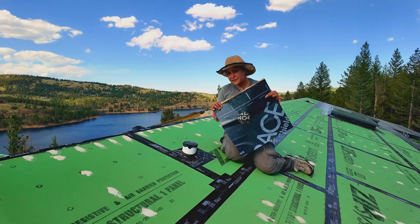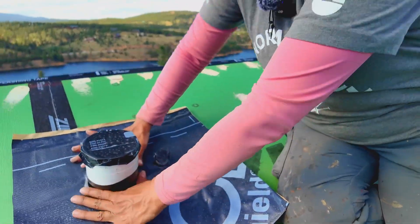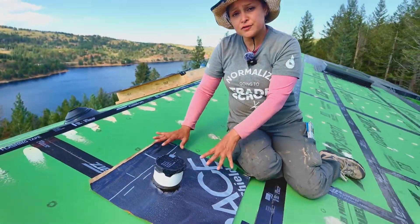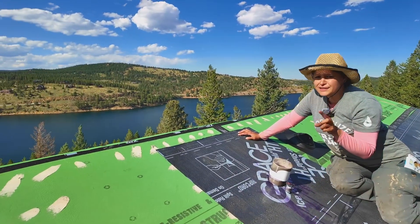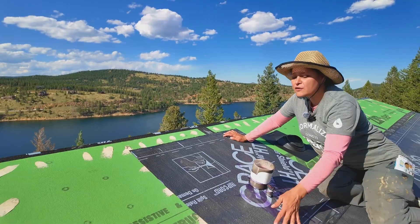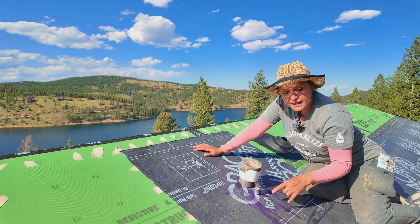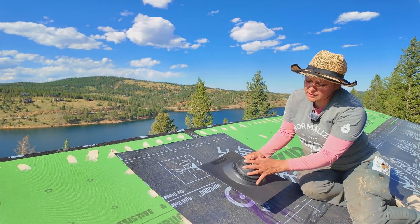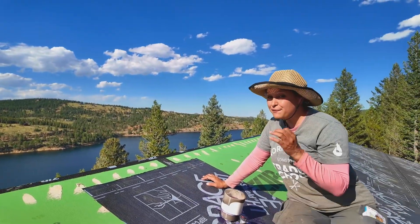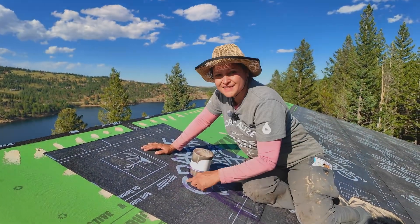When you have penetrations, I recommend creating a template, as you can see with this small piece — this way I can make sure everything is going to fit as I like it, and then use it as a template for a larger piece. Here I have one already installed: first I applied my template, then I installed a much larger piece that allows me to follow shingle style and have enough space for all my overlaps at the bottom and on the sides. To finish, I'll come in with my plumbing boot. And one very important thing before putting the boot on: apply sealant all around it to protect that transition.